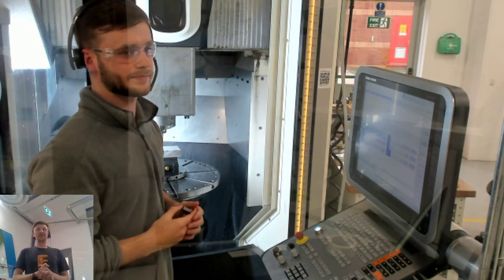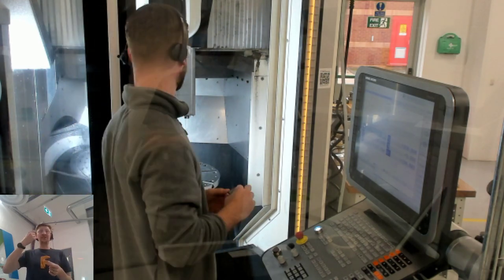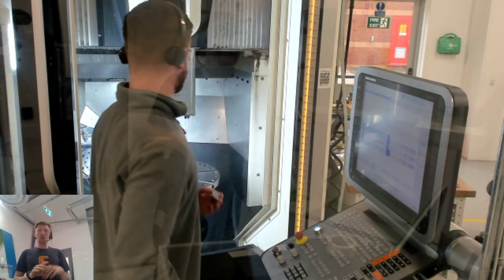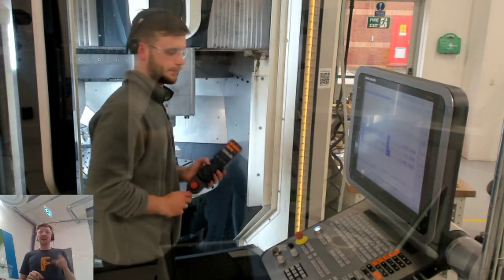I've definitely been victim to holding a 10 mil slip block. I think it's like 9 point something on the one side and 10 on the other. It's the faces that look like they're mirror finished that are the faces you want to have.